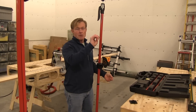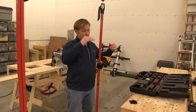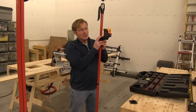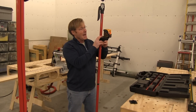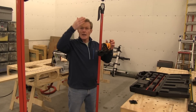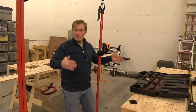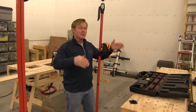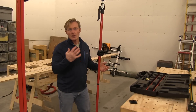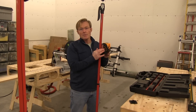Typically how I work: I set up my laser, I have a mark on the wall where the top of my bases or the bottom of my uppers are going to go. I set my uppers first. I'd put it right on my line, then set my uppers right to it. With this laser — any laser — it's also got a vertical line. I use the vertical to line up uppers and lowers where there's an upper above a range area, with cabinets on either side, to make sure those get lined up perfectly. Also for refrigerator openings, and for putting on horizontal trims when matching around a room for windows.